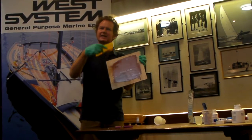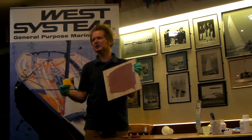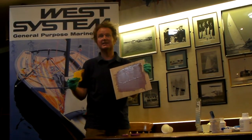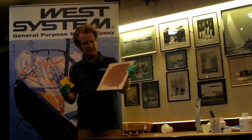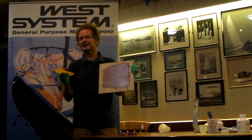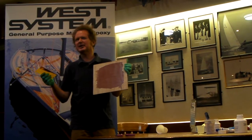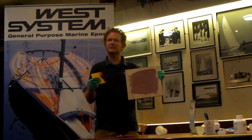You can see you've got something really nice and smooth. If you use the squeegee at a nice shallow angle, you can feather it out and do a lot of work while this is still liquid - that's the most important thing. Try and fair it up like a plasterer before it cures, because nobody will give you five gold stars for sanding, however good you are. Although this is easier to sand, it's got about the same density as mahogany. We've got another filler called microlight which is very easy to sand but quite soft - you get a fingernail impression in it - so it's not the ideal filler to use on a keel.